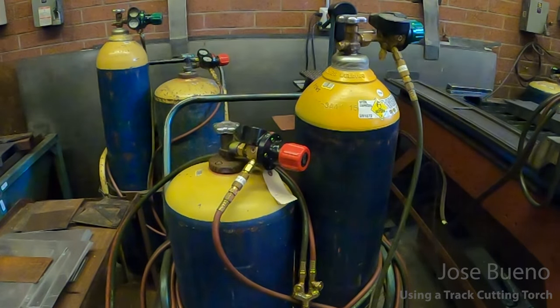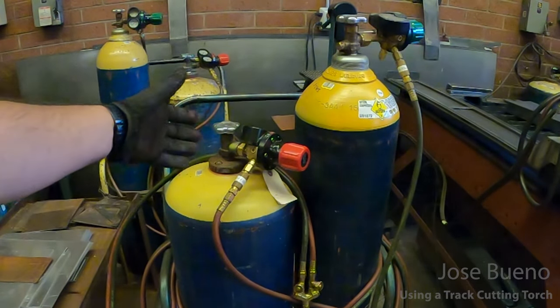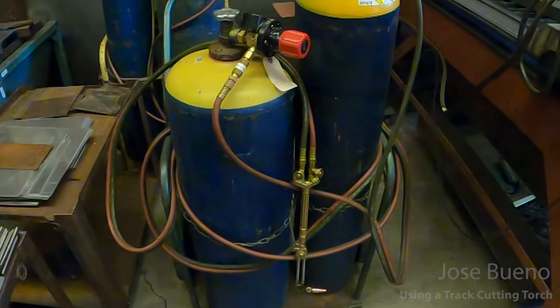So when we start talking about cutting metal, especially the processes that can be used, there are many different processes. There's water jet, there's laser cutting, there's plasma cutting, there's oxyfuel cutting or torch cutting, and there's also electrode cutting. To pick up where a couple of my previous videos end off using oxyfuel, we have our standard oxyfuel setup. We have our acetylene, which is our fuel gas, our oxygen, which also provides the cutting pressure, and then we have our cutting torch.